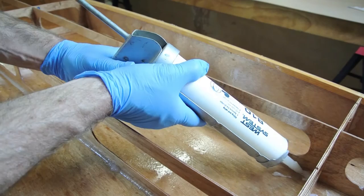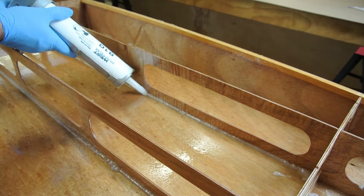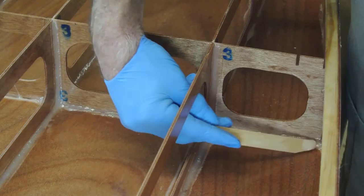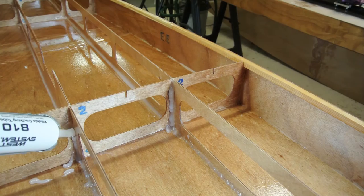For examples of this, watch the epoxy basics video on the website. Once you complete the smoothing of the fillets with the filleting tool, you can mix up the second batch. It will take about two triple batches to complete the filleting. Since you are working with a larger batch of epoxy, remember that it can produce more heat and start to set up quicker, so work efficiently and move through the first batch quickly. You should work through the first batch in about 10 minutes.